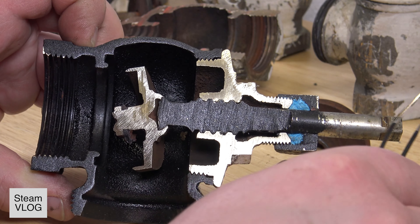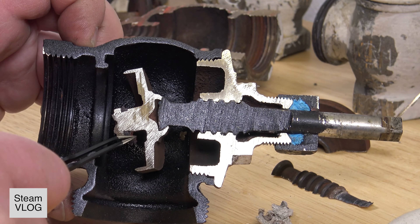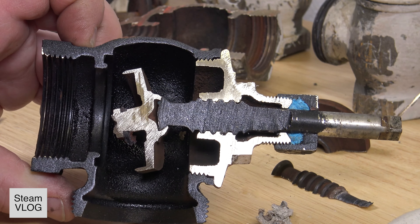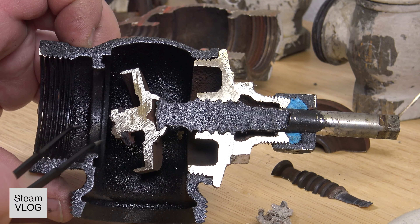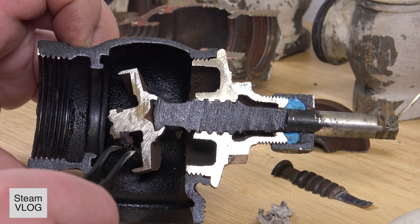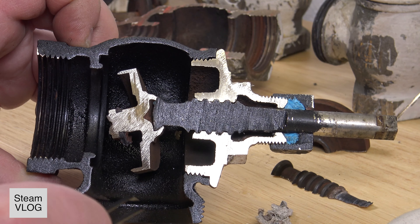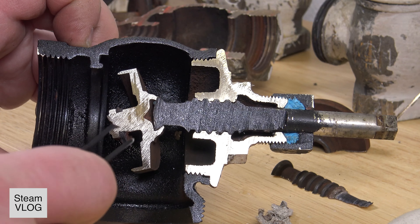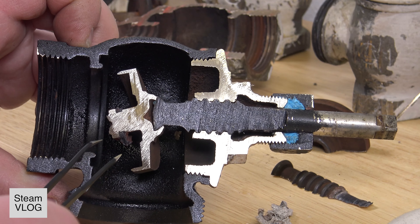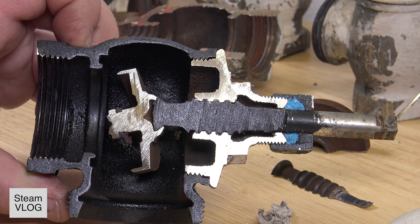This valve would usually be more open. This is a very old one, and the rubber gasket that is in here is missing already. Because steam is constantly going through here, it will take the gasket out over time — the gasket will disintegrate and be pushed into the radiator, or be flushed down into the pipe by water. The gasket usually gets very hard and brittle, breaks in half, and then half of it is laying here blocking and getting stuck in the pipe.